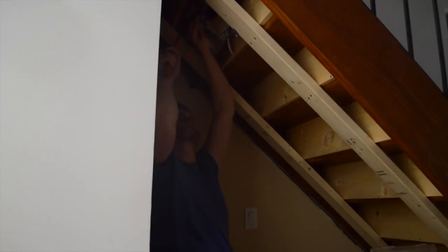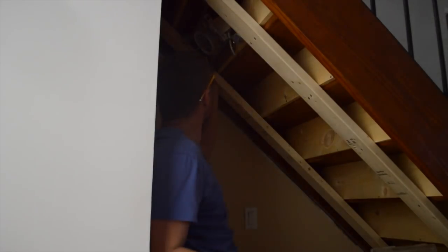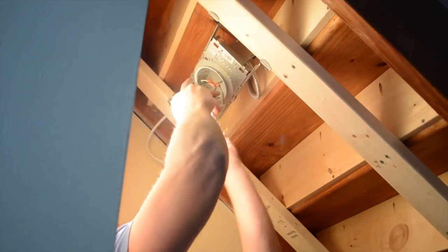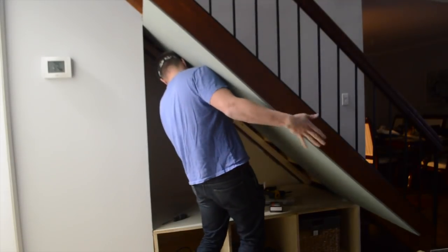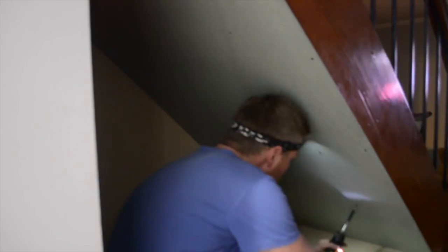To keep the light hanging, you need to bang the nails that are on the sides of the hangers. It can get pretty cramped doing this. The housing is adjustable up to 16 inches in either direction, which makes it pretty easy centering it up on the ceiling. Once the light was in, I cut some drywall and inserted it at an angle after several times cutting it to get it to fit. Use a drywall saw to cut a hole for the light — make sure you remember where you put it.